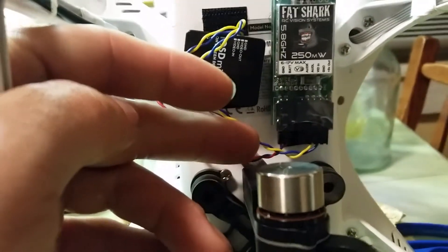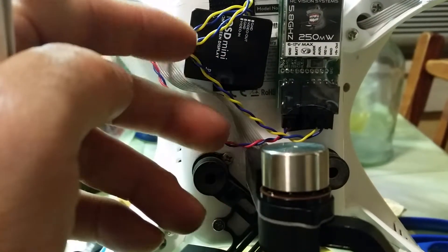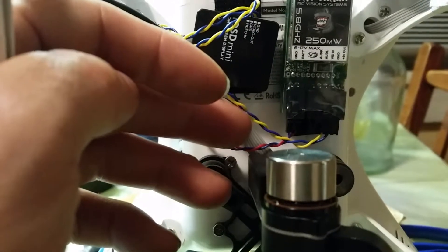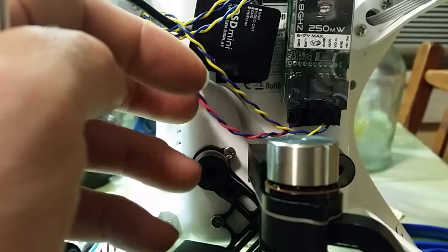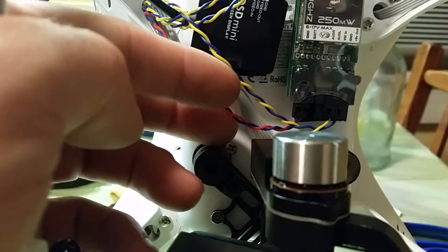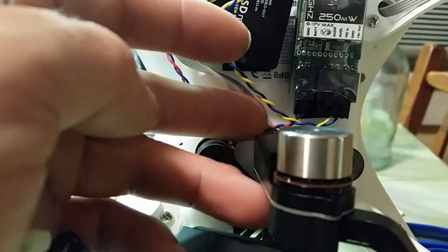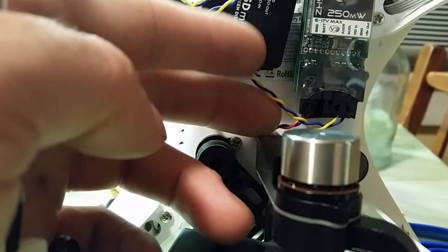If you look at the receiver, the plug-and-play cable is going in. The plug-and-play cable actually came with a warning letter in the package saying it's not meant for the Fatshark and that it's not just plug-and-play — you have to do a little bit of wiring. The blue one is the ground and the red is the hotline; these were actually switched, so you just have to take the wires out and flip them. The yellow is the video in and the blue is the ground — I had to switch these.